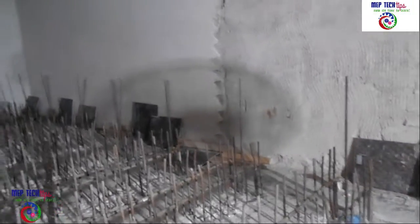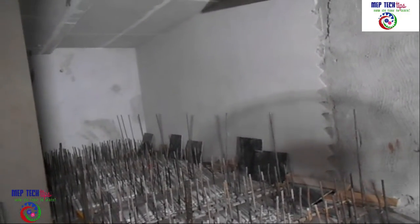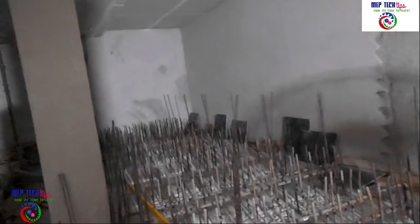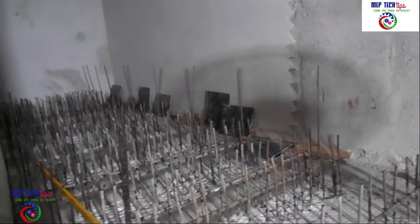Because of this 100mm increase we are facing a problem, so I raised an inspection to the consultant. I came here, checked the height, the length, the gap between the two foundations, and found the height was increased. I raised this issue to the consultant because the height available above for maintenance is very limited — a person cannot go inside. I rejected the inspection on my side before raising it to the consultant. You must do your own inspection before raising to the consultant: check everything yourself, satisfy yourself, then raise the inspection to the consultant so you will be in good shape in front of the consultant.